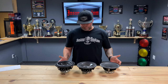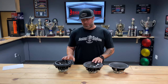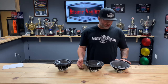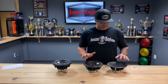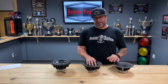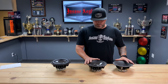I've got three different 8-inch Euphoria Expert Series speakers. These two are mids, this is a mid-bass. There's a big difference in what's a mid and what is a mid-bass. The difference between the two actual mids is that one's a carbon fiber cone and one's a paper cone — it is a treated paper with some water resistance properties, but we'll just call it a paper cone. The paper cone will have a much higher sensitivity than the carbon fiber because of the weight. The carbon fiber is going to have a lower FS and play lower, also because of the weight. So there are different applications for both, but these are still both considered mids.